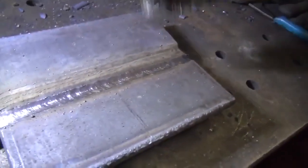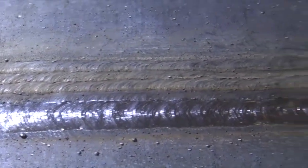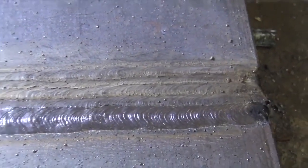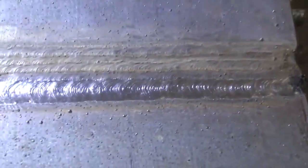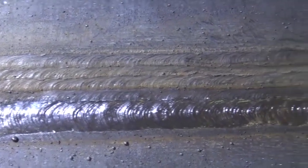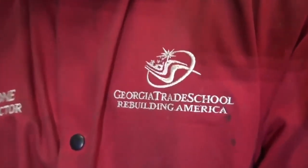We are officially capped off. Five-stringer cap, everything went pretty well. The plate is screaming hot, but we're just above flush. When running the 7024 rod, keep in mind it is hot, it deposits metal very fast, and it has an excessive amount of spatter — similar to a 6010 — but all in all it has a very clean weld profile, as you can see. Big thank you to instructor Steven from the Georgia Trade School — link in the description. Thanks for watching everyone.